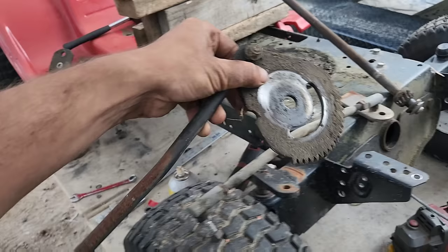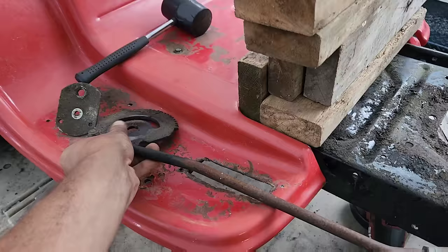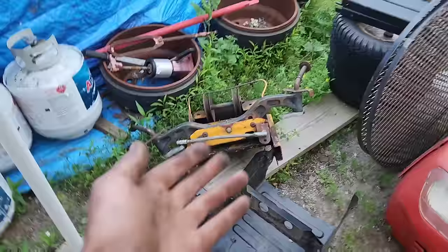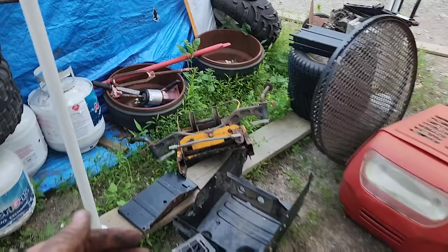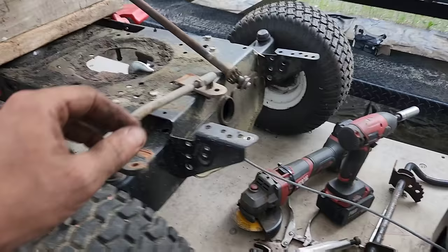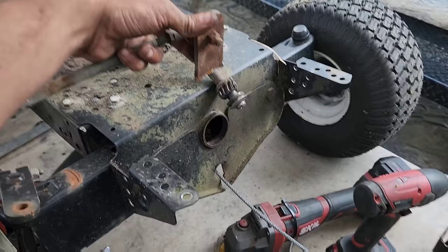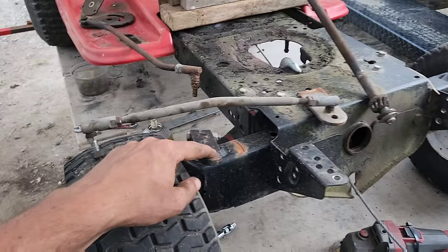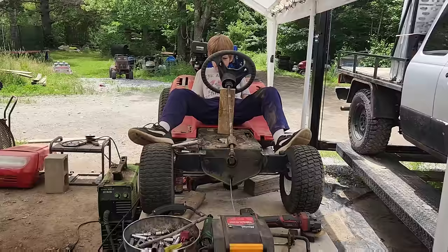Since this is mangled and unusable, what I've got here is the link bar for Cub Cadet steering out of the junkyard. These are quite common in steering for a lot of your MTD slightly bigger machines nowadays. So if I come back here, I've got this piece and that piece - I can weld right on there to have our top piece, then shorten it up, put this right in here, and we should be able to have our direct-link steering.